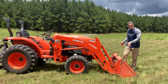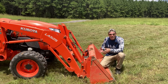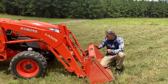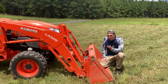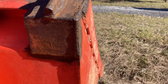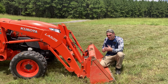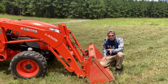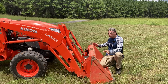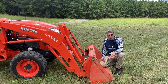Because I don't have a third function for a grapple, things I put in my bucket tend to want to fall out. So I had three hooks welded on the top of the bucket — they're buttressed with extra steel on the corners, and the center hook is welded to a reinforced section from Kubota. If you get a tractor with a front end loader, one of the first things I recommend is having hooks put on your bucket. There are bolt-on hooks, but I don't recommend them — welded hooks are stronger, though a bolt-on hook is better than nothing. Some people even put a clevis inside the bucket, which helps strap things in or secure clamp-on forks.